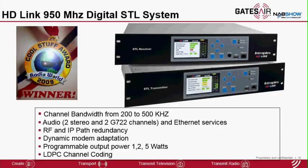Moving on to HD-Link, there are two main capabilities to remember. One is superior RF performance enabled by integrated five watts of power and LDPC channel coding. The second is backup capability — should the RF link degrade, the system can automatically adjust the modem parameters, the QAM rate and the channel coding rate to stabilize the link. And should the link completely fail, it has the option of sending traffic over a backup IP path.